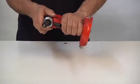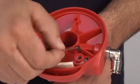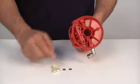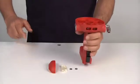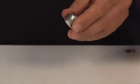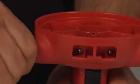Remove the oil dynamic cylinder from the handgrip. Remove the two lower O-ring gaskets from the handgrip. Remove the silencer. Then, remove the deflector. Loosen and remove the valve plug, using a 6 mm hex key. Remove the coil together with the relative spring.